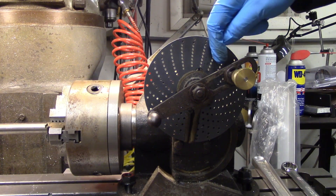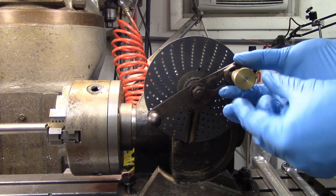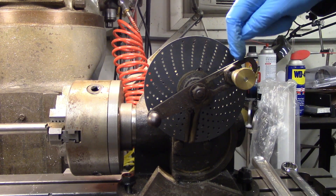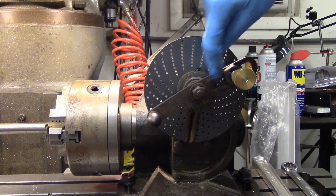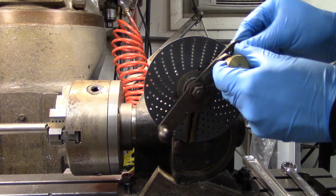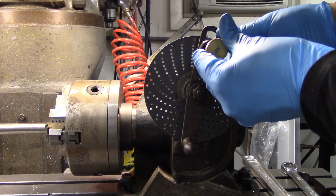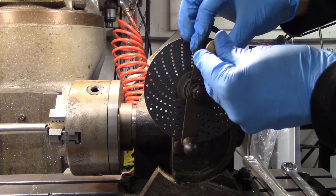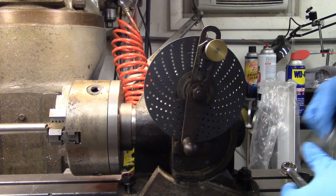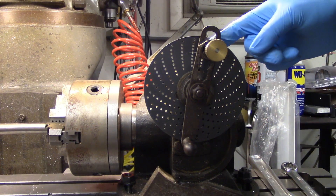Choosing which circle you're in is pretty easy. On all dividing heads you're going to have this pin, and it's being held in place with a nut — when I loosen this I'll be able to move the pin in the slot. I'll bring this back up and make sure to line up the pin in the 22 slot. I'll snug up the arm but not go hog wild on that because I don't want to accidentally bend my pin.